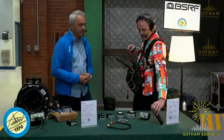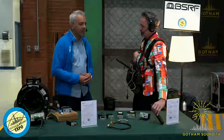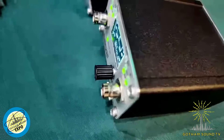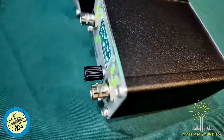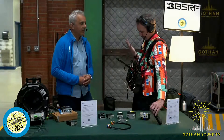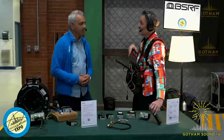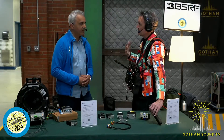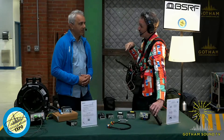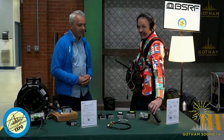Does each input have DC bias power? Yes, you can apply DC feed on each port and select or deselect whichever you want. So in a very small box, you can take four antennas across two zones and split to four receivers. Since most receivers these days have two or even four receivers in them, you could conceivably have RF distribution for 16 channels.